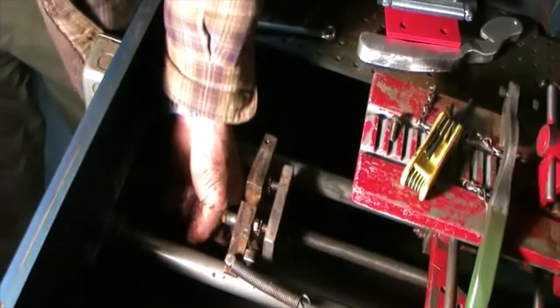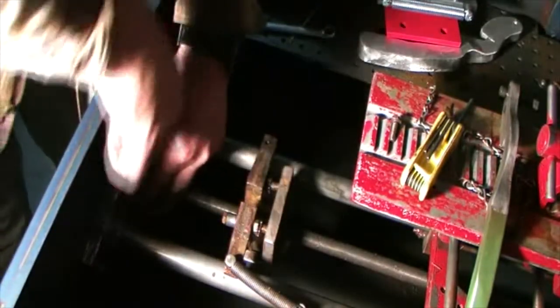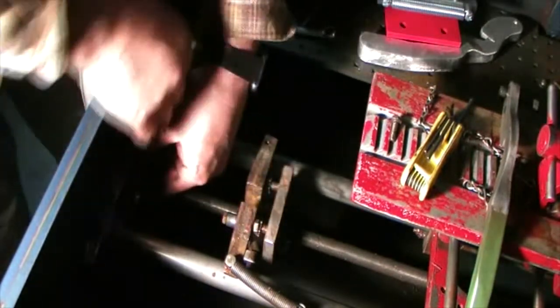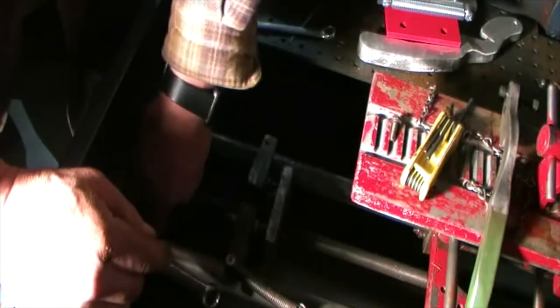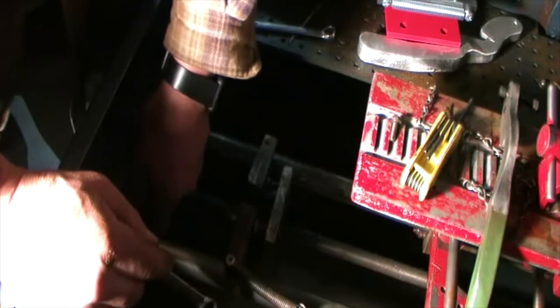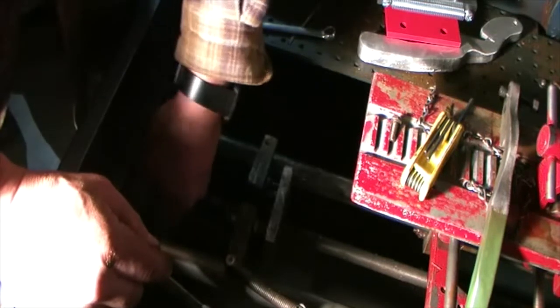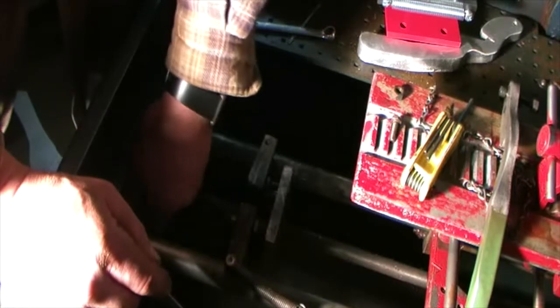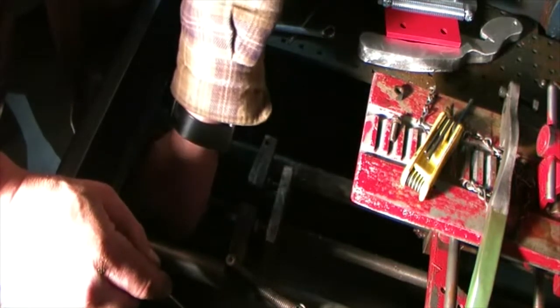See, checking here too, there's some wear in there. I do have bushings, hopefully they're the right ones, so this one's going to get bushings just like the HP did. So pretty much you have to take the drive shaft out. That's just a nut on a stud with a star washer. I can feel that with my fingers.